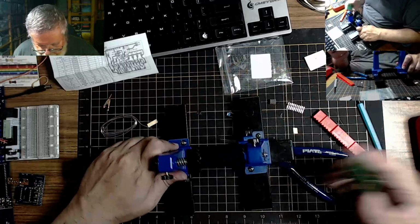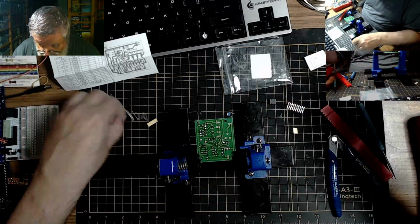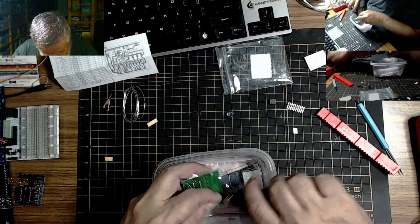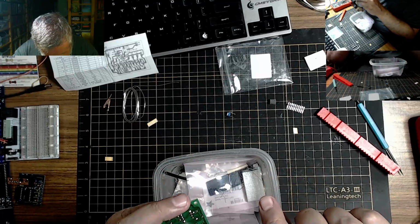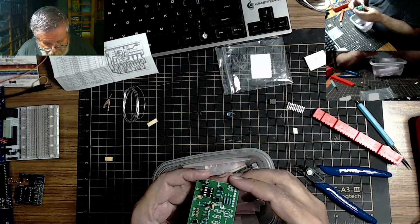Okay. Time for some soldering. Now these are important that you don't be slow on these. You don't want to melt them, meaning don't let heat transfer through the legs. There we go. Trim them off. We've got the transistors done. These will really go flying because they're a stiffer leg. Okay, so the two transistors.